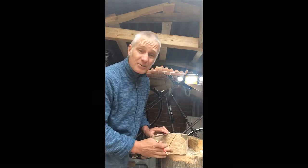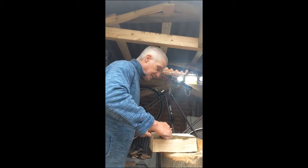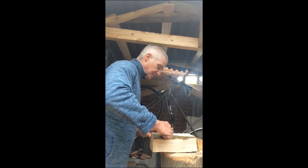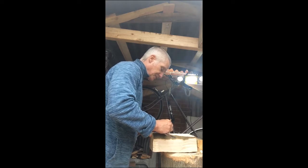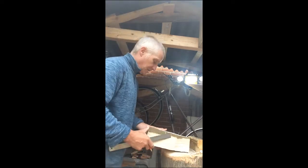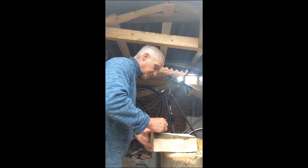So it looks like we're going to get rid of a lot of that chipped wood. So in there, in the middle, we like to do about 2 centimeters, 4 centimeters, 3 centimeters. Let's do 3 today. Why not? The waist part, the sort of waistline part of the Kuksa, like that here. You'll see in a minute what I mean. And then at the end, we usually make it about 3 centimeters, so the widest part of the fishtail.